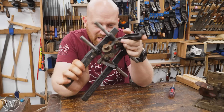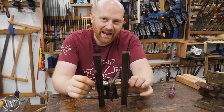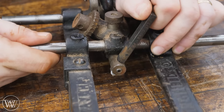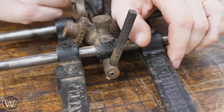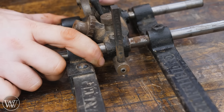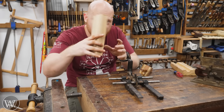A couple of other companies came up with this different design. The interesting thing about this one is it doesn't slide inside that core — it actually houses on the outside of the board. The board then slides on these rails as it runs through, and this finger cutter will take a small slice out. Every time you advance the wheel forward, that cutter rotates just a little bit. You can see as I turn this, it rotates through, and on every pass it takes off a little bit more material around that corner.